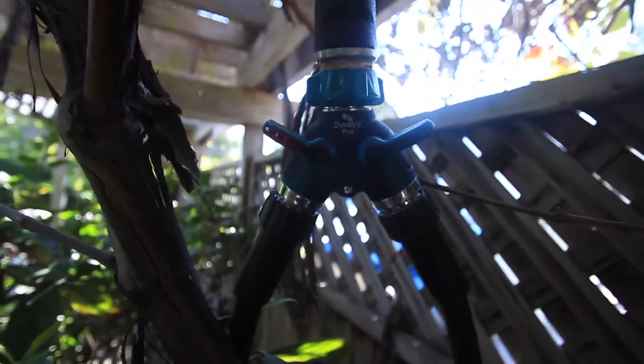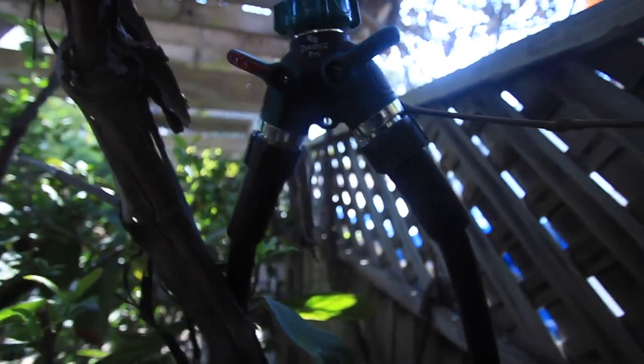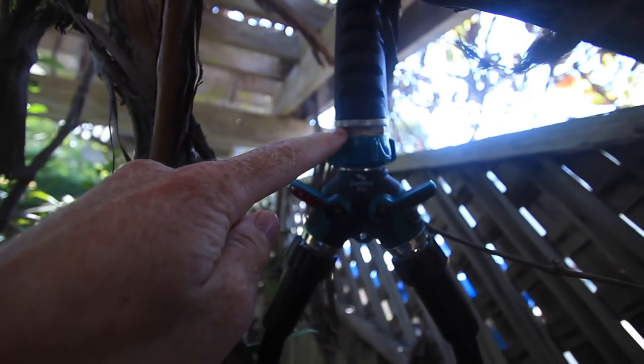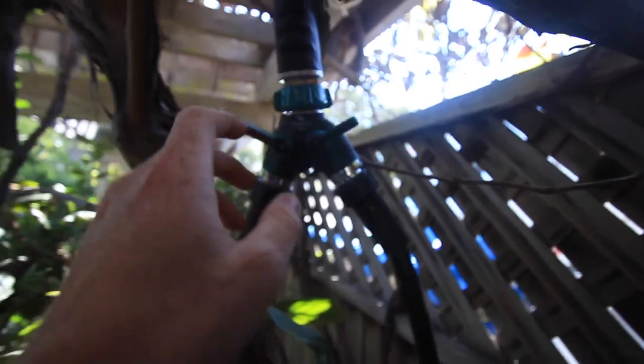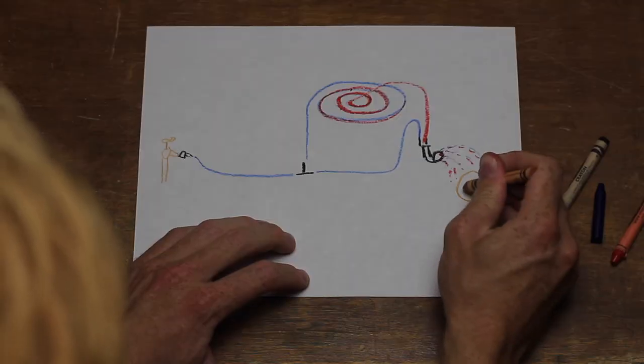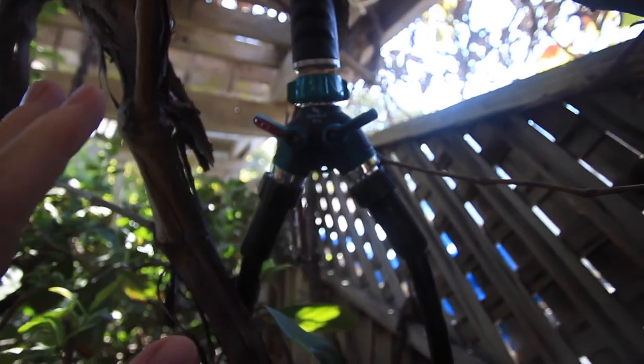And right here, we got controls. We got the hot, and we got the cold. The cold is coming in from that split I told you about. So half the cold goes up to the solar collector, and half the cold comes up to this side, which is actually a splitter, but I put an adapter here to adapt it into a combiner. It's actually so hot, you need to combine cold with it most of the time so it doesn't burn you.